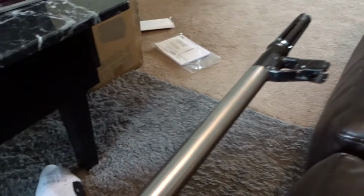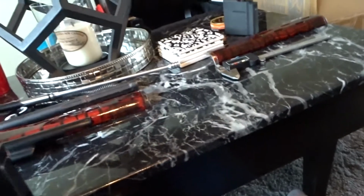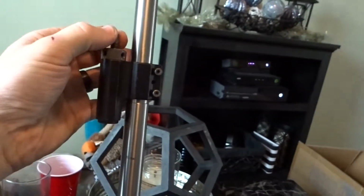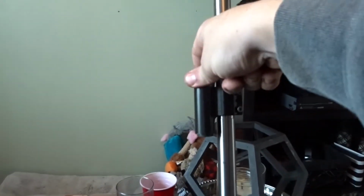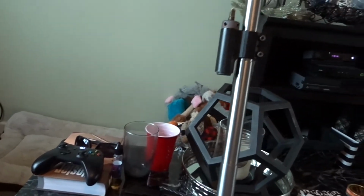You can see our adjustable gas block, that plunger in there, and the gas hole is so over covered that it's not even funny. You can barely even tell there's a hole there at all. But it does function perfectly, and right now it just limps the cases out because that's what we wanted in case I decide to suppress it or something like that. And I can always adjust it. There's just simply 4 set screws and then give a little twist of this and then it's adjusted. So it's nice and easy to take care of, nice and easy to maintain. You can pull this thing the whole way out to clean it instead of getting the gas tube off and everything. You can just run a brush down it, good to go.